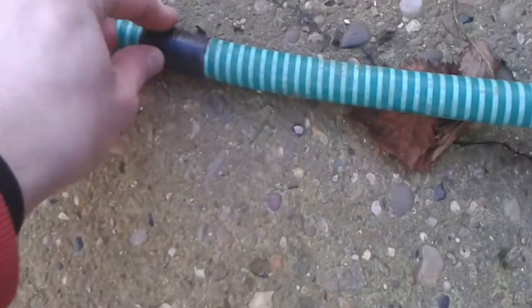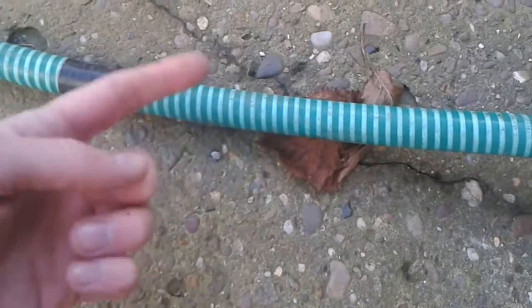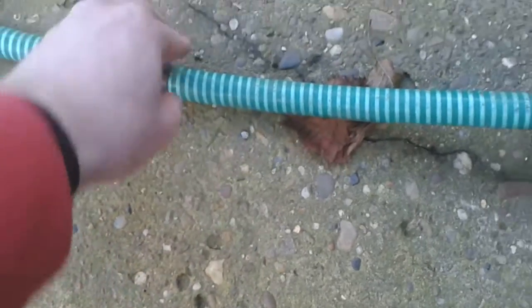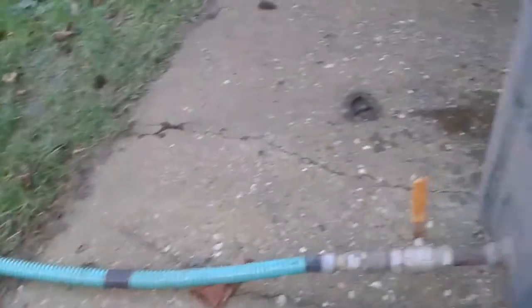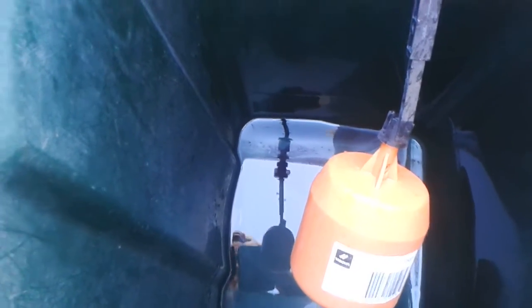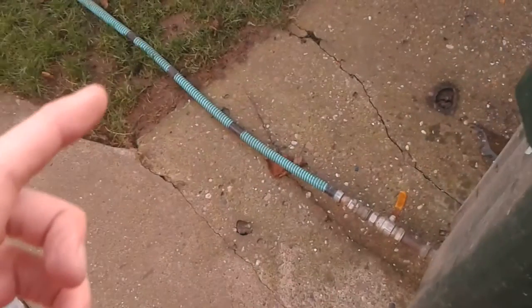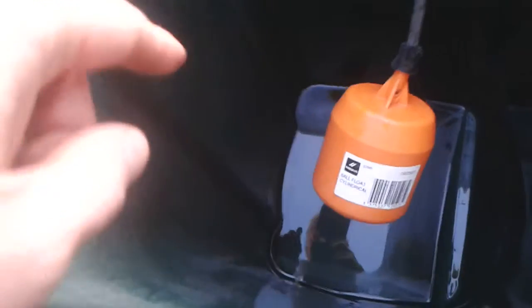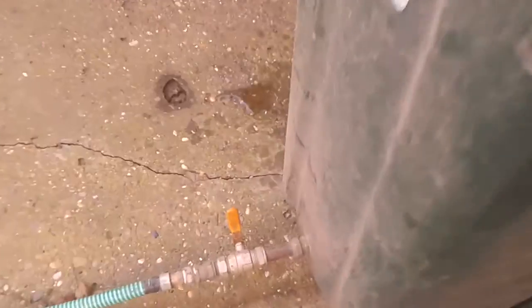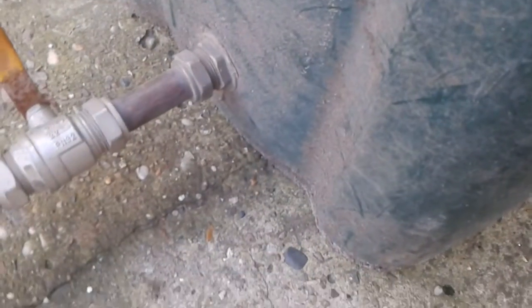To make a patch, when you find your hole, just wrap no end of PTFE tape on it, and I've got some black electrical tape just to protect the PTFE taping. And then at the very bottom there, the filter from the hose — this hose is just what you would normally drop into the top of a tank, but because I'm gravity feeding it I didn't want that, so I just take that off and fit the filter barb into where I've drilled the hole for the tank fitting, so you've still got your filtration there to catch little bits of grit.